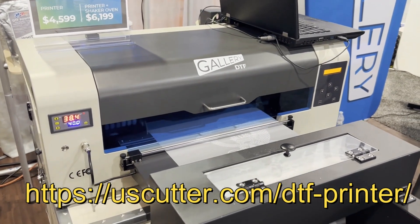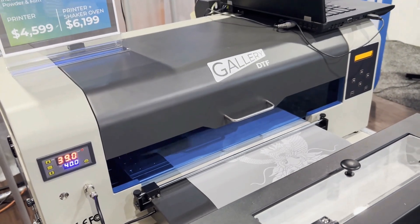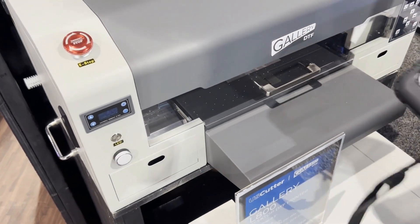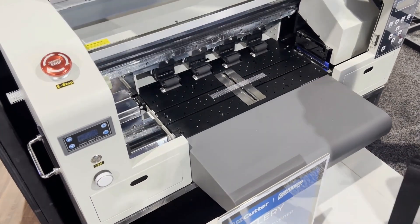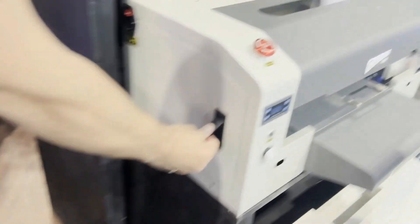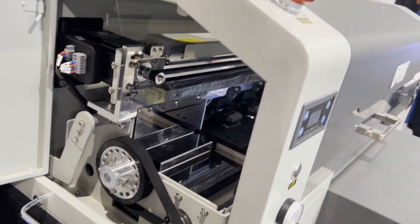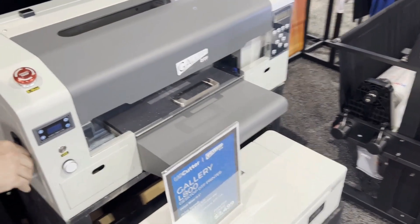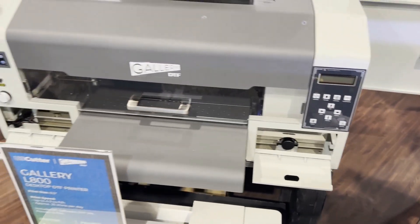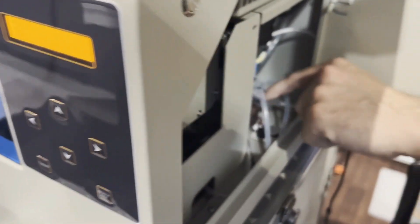The second machine is built by U.S. Color, a U.S. company. This is a single print head XP600 and the price tag is $4,500. For $8,500, you can get the same spec as the F Color printer — dual head and LED light in the service area. Overall, the inside core is pretty similar to F Color: independent paper roller, step motor, and the side panel is also removable. They have a nice paper feed motor and the print head carriage is on a linear rail. The right side panel is also openable and the service area can be easily accessed. The control panel is on your right.